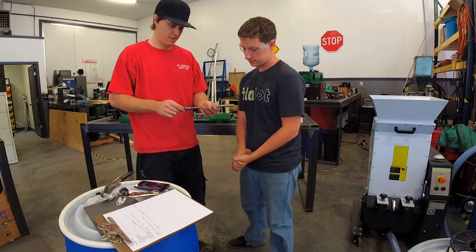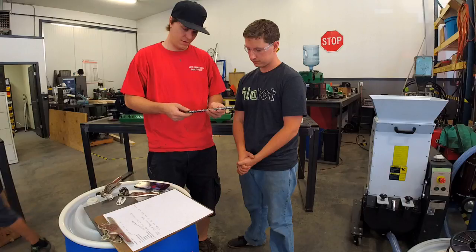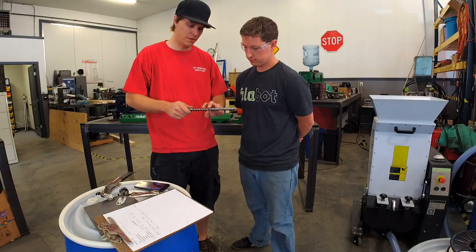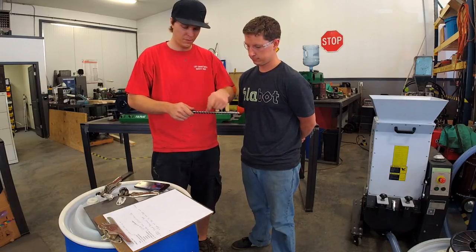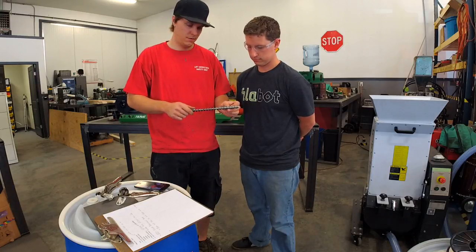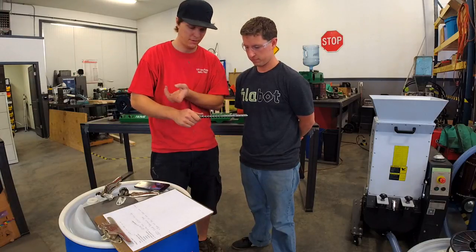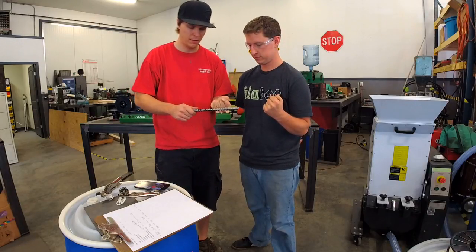Alright. Well, in plastic extrusion, you have to melt the plastic to extrude it. Why? You do that mainly by shear heating it, also through conductive heat. But the screw is designed this way to create a pressure within the system. So consider the plastic going around the screw. It gets tighter as it goes out towards the end. So you have solid plastic here. It's little pellets, there's air in it. As it goes across the screw, the air gets pushed back out. The pellets get smushed into a solid, it's called a solid bed.